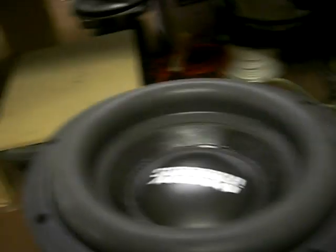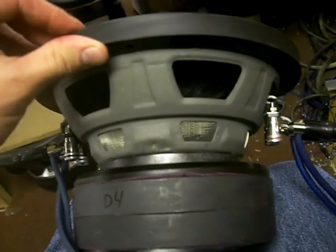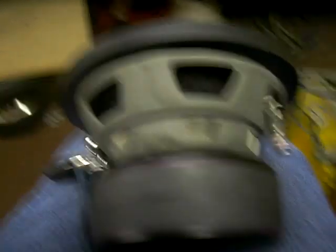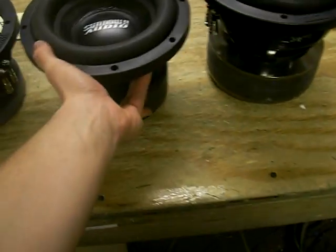So that's really not bad for an entry-level woofer. This thing's going to be selling for under $100 — really all you need to be anywhere near the 300-watt rating on it. Although it's pretty underrated, the power handling is not going to be that much less in reality than the original version of the S8 V1 and V1.5. It's got a little bit shorter coil, but not a tremendous amount shorter. And we're going to compare it to the SD2 and the S8 V2 here as well in depth.